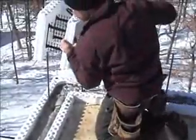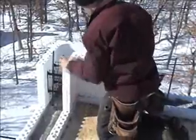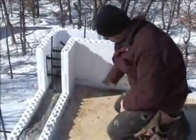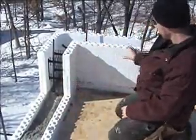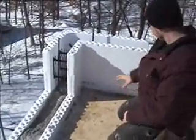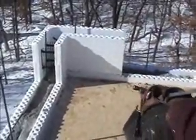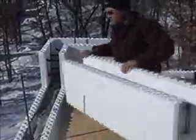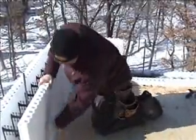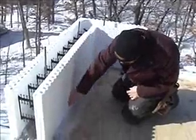Place the form over the rebar — and that should go like that. Press down, make sure that locks firmly in place. You can also see that our last course broke here and here, so I've alternated it, so now we have a seam here and here. This helps to eliminate discrepancies in the width and helps to lock together the previous course forms. This next course will lock in place like that. You can see our ties line up with the forms below — those are continuous all the way through.